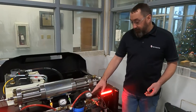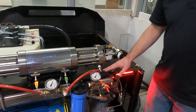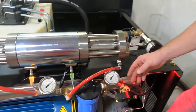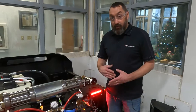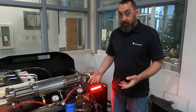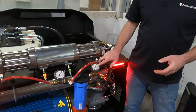We're going to start up our pump now and see what our pressures are at. You can see right away our pressure looks like about 100 psi there. We want to see 80 to 100 psi ideally. Your alarm will happen around that 40 psi mark, so if you get below that, the alarm will trigger.